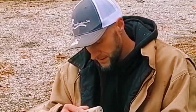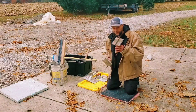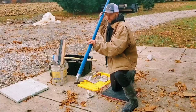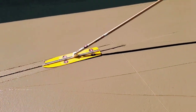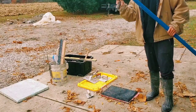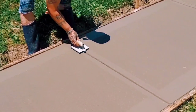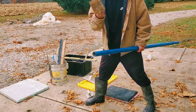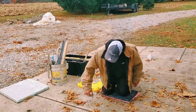This is called a joiner — a walking joiner, for shining your ribbons and tooling in your joints when you're out on knee boards. This walking joiner is pretty sweet because you can stand off the side of a pad, get it in your joint, and shine your joints. I don't think every finisher should have one, but they're sure nice to have in your bucket. Picture frame — a lot of states don't picture frame their joints, but in Indiana it's the way to go. So in Indiana every finisher should have a shiner on a pole. But definitely have a hand joiner — every finisher should have a hand joiner for pounding in those joints.